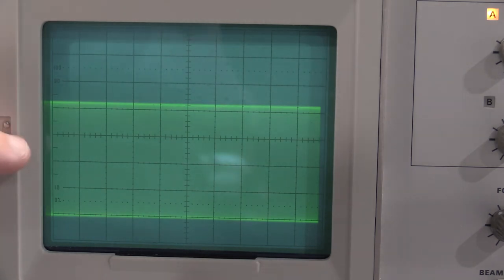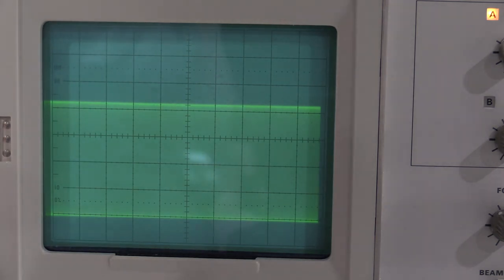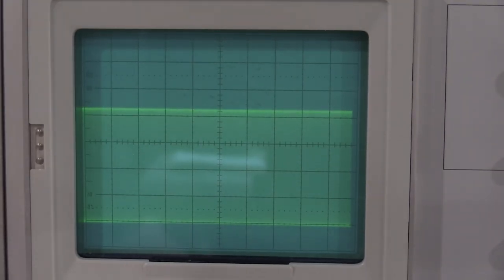On these, this and the high frequency compensation are really where these plugins need adjustment. I've fixed a whole bunch of these, usually in the trigger circuit, the positioning, the identification, stuff like that. That doesn't have a problem. Somebody can have fiddled with the gain. So the gain and the high frequency compensation and the bandwidth, if those all check out okay, you are usually good with a plug-in. Obviously, before you use it for hypercritical measurements, you should do a full system check for your equipment just to make sure you have confidence that it's working correctly, which is one of the reasons why I'm doing this.